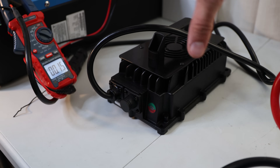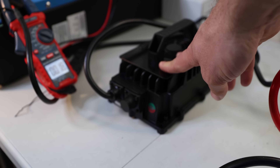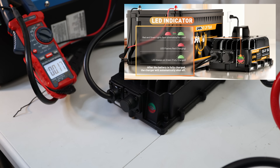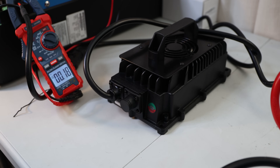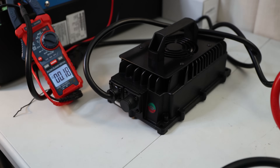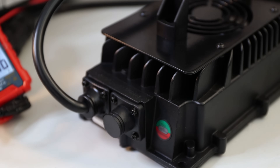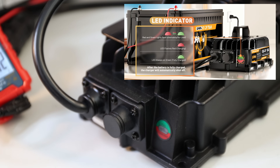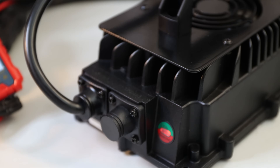When I measure I want to make sure I can see both readings at the same time — that's very important. I've plugged everything in. The charger has a little indicator light here, and I should be able to see it illuminating. Let me turn it on. We have a red-green light — now it's just red and flashing slowly. When it's slow red flashing, that's the fast charge state; when it's fast red flashing, it's the pre-charge state. It looks like it's in slow-flash mode.